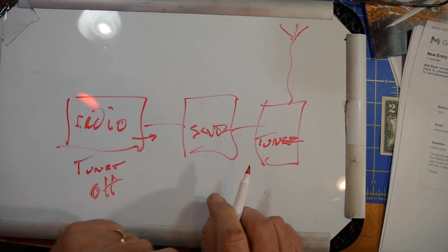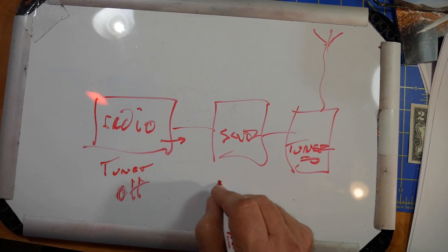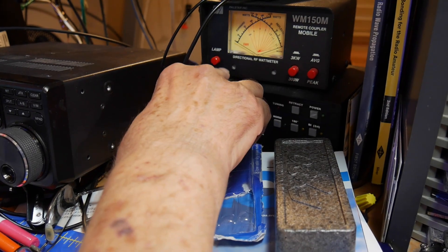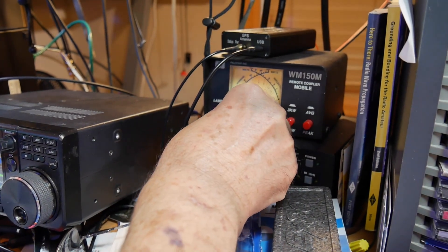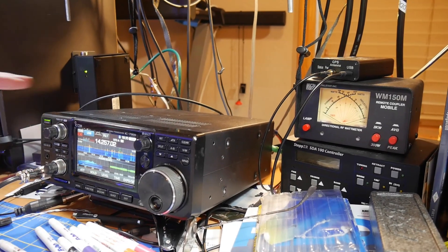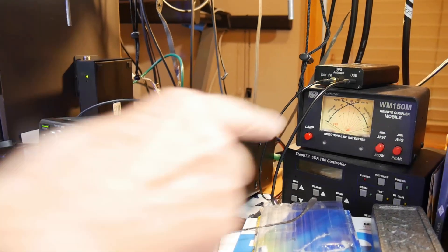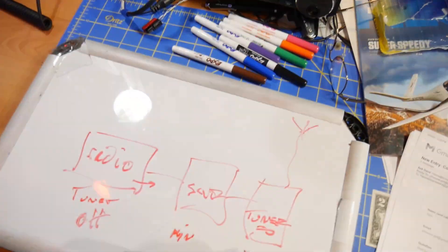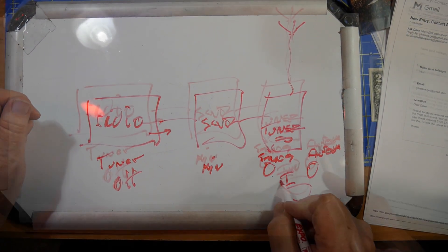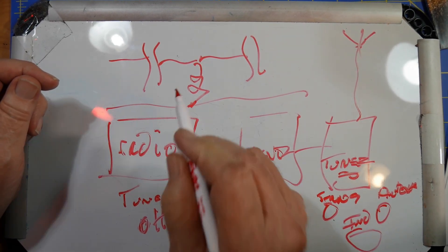Put out a small amount — five to ten watts will do fine — and tune the tuner for the lowest SWR. I usually tune for minimum reflected power when using an SWR meter. On this power meter here you have forward and reflected power; the way to tell SWR is where the needles cross. It's easier to just tune for minimum reflected power. The antenna tuner typically has three knobs: one marked transmitter, one marked antenna, and the middle one is inductance. The circuit inside has a capacitor, an inductor, and another capacitor, with ground touching the bottom of the inductor — all three are variable.